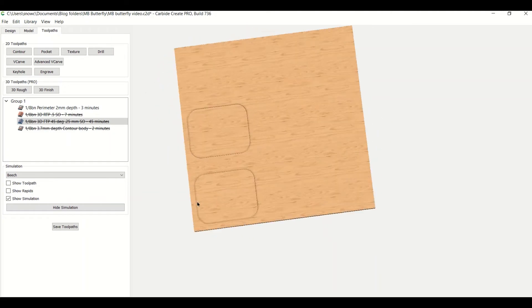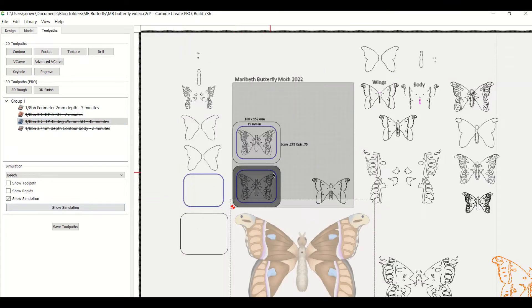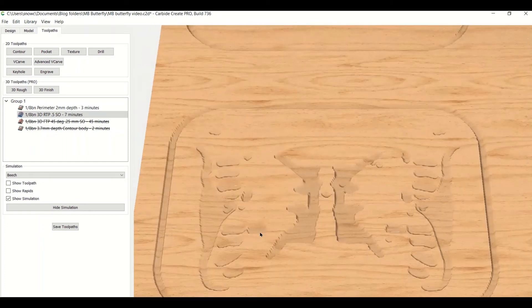So that's the internal perimeter. We're also going to need a final cut around the outside edge, which I don't have set up yet — you can do that with a saw or with your router. Turning on the next one: this is the rough toolpath, and for this we're using an eighth-inch ball nose bit. You'll have to set your own feeds and speeds because I don't know what material you're using. The rough pass gets rid of the bulk of the material to leave everything for the fine pass.